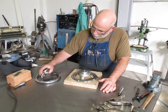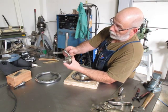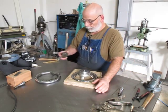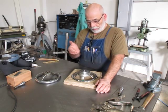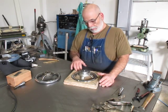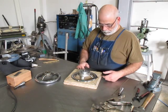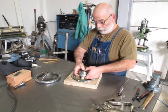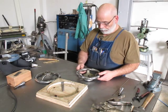The other thing with cast iron is you can see it's kind of dirty and might have oil on it, so you've got to clean it and bevel these edges and get some weld prep on them. What I did is I used a grinder with a cutting disc and V'd the areas I could access while it was in the fixture. I get some tack welds on it, then work my way around with the V grinder and backfill it with weld. My wife wants me to fill all this up and blend it, but that's a lot of work for minimal results.